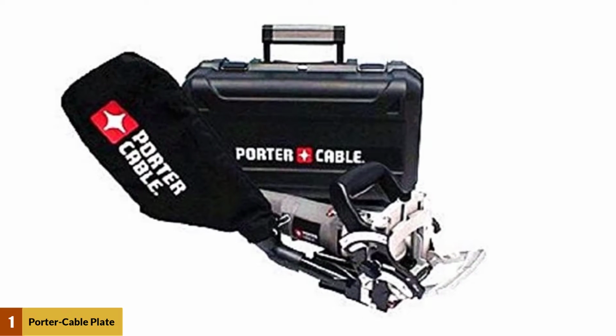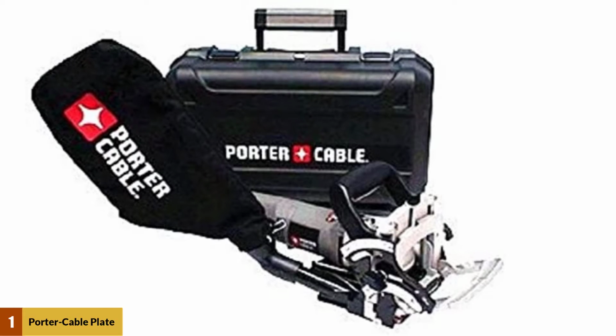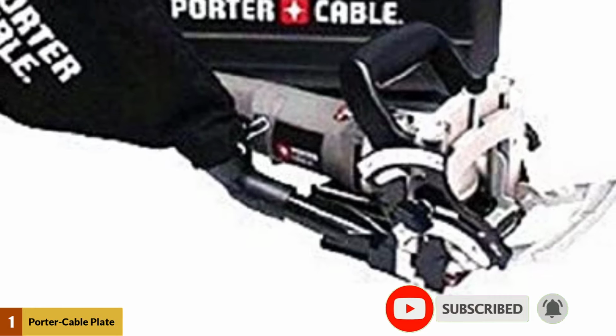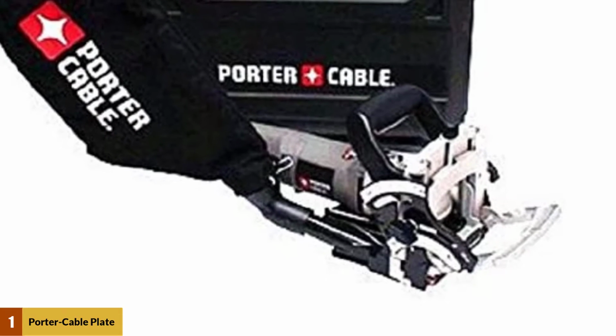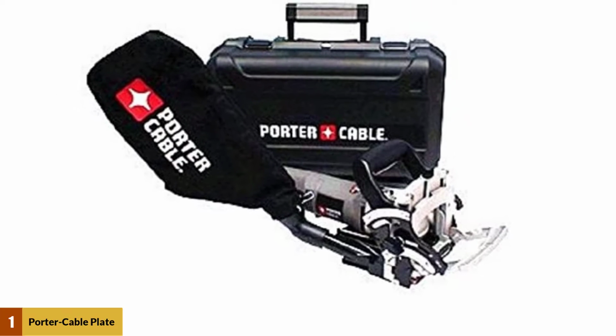90% of cuts are going to be at 90 degrees, but this joiner can do more than that. The stainless steel fence tilts from 0 degrees to 135 degrees for a variety of bevel cuts. It has a 7-position rotating depth stop for FF, number 0, number 10 and number 20 biscuit sizes, and simplex, duplex and max number 6 biscuits.